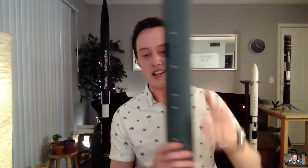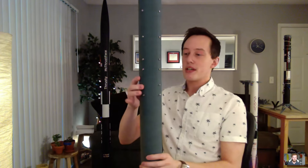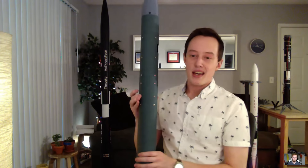You can see two holes in the vehicle right around the centre of mass — it's actually slightly below the centre of mass, so the vehicle wants to fall over. What I've been doing is setting it up in a mount where it can rotate on two axes, and just loading PID values and giving it a shot — trial and error. That's not how it really works in the aerospace industry, but these are model rockets, so I guess if the job's done, the job's done.